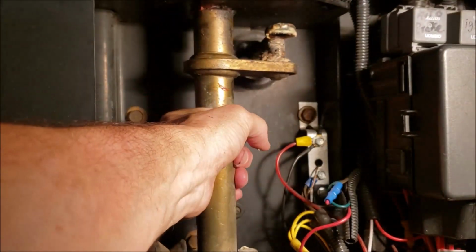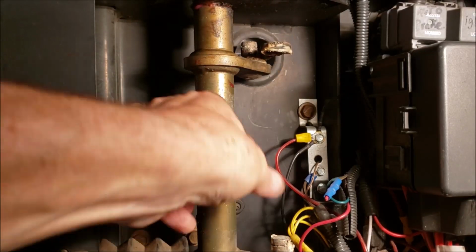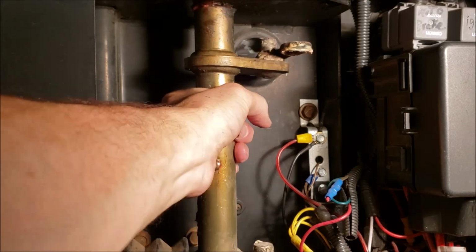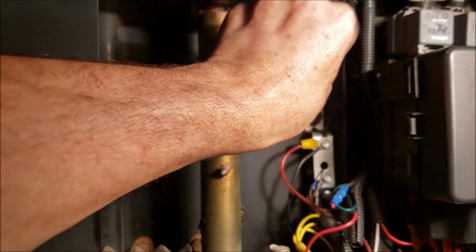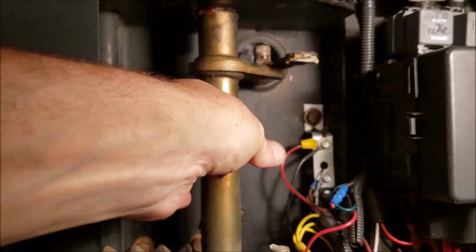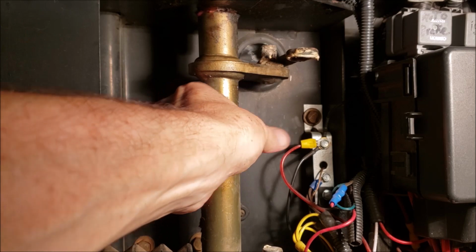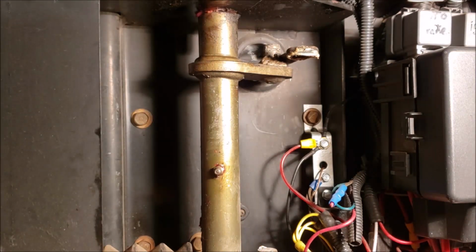All right. Now. Okay, so now I got no more squeak. So the squeak must be coming, yeah, it's coming from the brake pedal. All right, so everything's operating nice and smooth. I'm gonna get me a little bit of some brake cleaner, paper towels, clean all these shafts up real good. And then I'll get some grease on the situation.